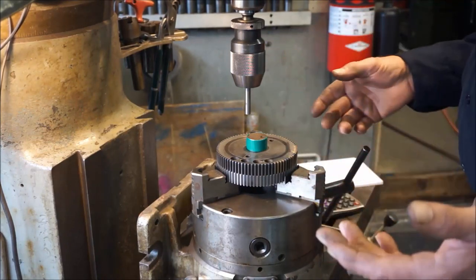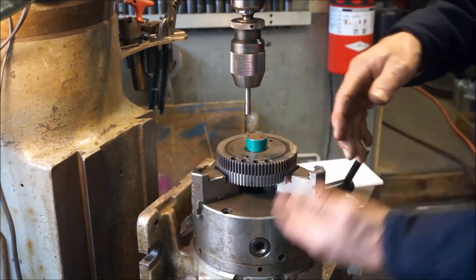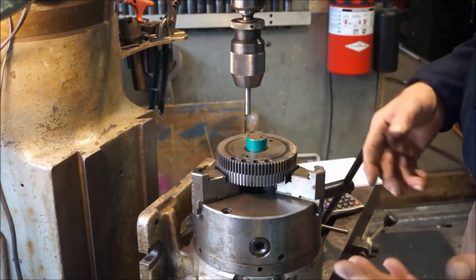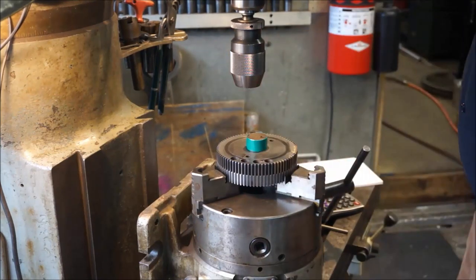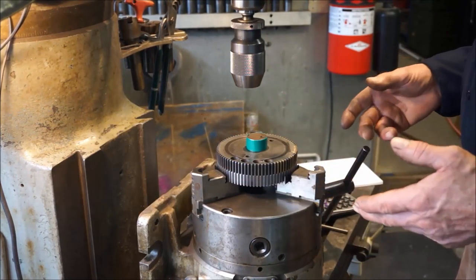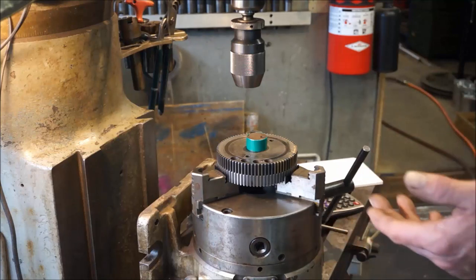Okay, so by doing this checkout, you're actually lowering your table and checking out your travel of your spindle in a distance out from where you're at. And if you are out with any significance, it will show up at that time. Just kind of a quickie self-taught inspection. There have been occasions where I have untrammed a head and went about doing something and never really trammed it back in, just kind of like eyeballed it square and kind of left it that way.